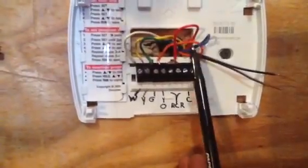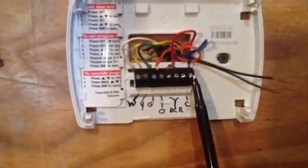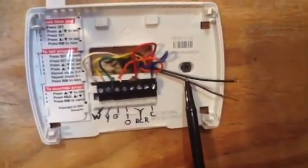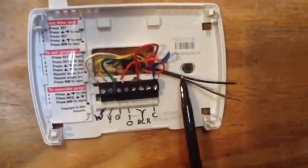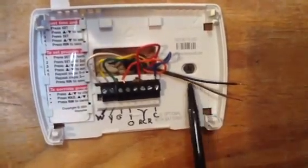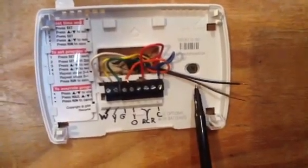Here's your common wire — it's usually blue most of the time. You see these other two wires to the side. If you have, say, a 15 or 20 kW heat in locations up north, you may have to use the black wire for heat, and a lot of times this is for an outdoor thermostat or something along those lines. But generally speaking, you won't even use those wires.